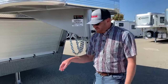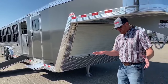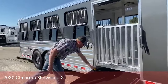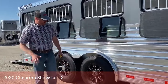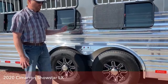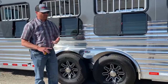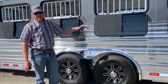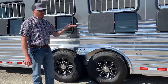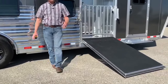Now we'll dive into the trailer. The other reason I picked this trailer is it has air ride suspension. I want to show you that right now the air ride is off and the trailer is in the lower position. When the air ride's on, it actually picks the box up. For this trailer, used for small animals — hogs, lambs, goats, calves — the box is lower to the ground right now. With the side ramps, if we pick the box up it will change the angle of the ramps and make it steeper for animals getting on and off.